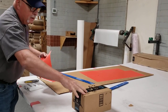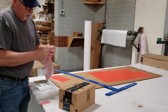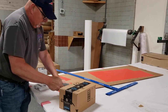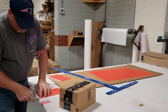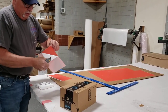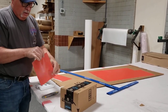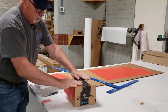You're going to want to — make believe this is a complex male mold — and you're going to want to peel the paper. A lot of times it's easy just to slip a knife between the resin and the poly, and then you get it to peel. You peel the paper off the material, and then you literally tack it onto your mold.